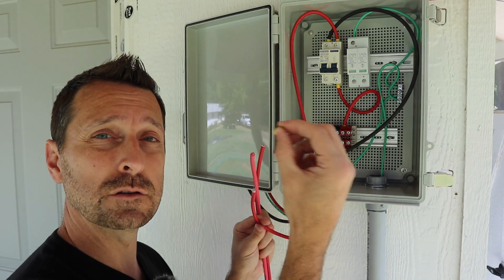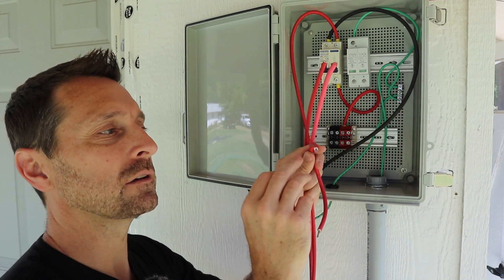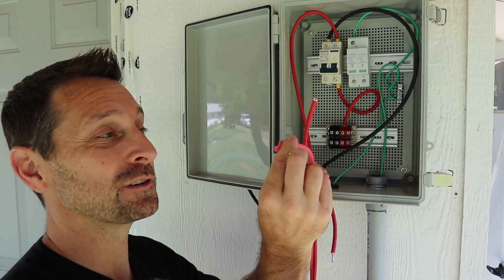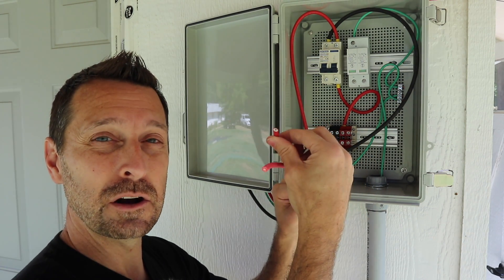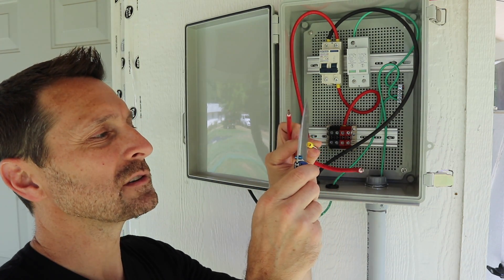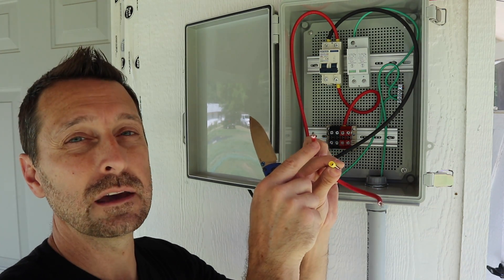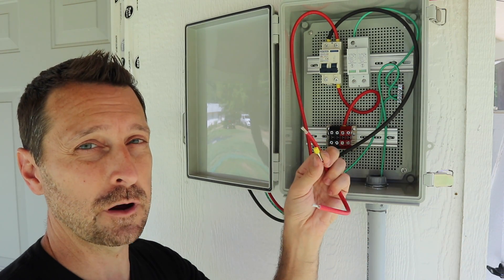It's recommended that you put ferrules on the end of your wire, especially if it's thinner stranded like PV wire is. However, most ferrules that you find, the little shroud at the end is too big to go on this PV wire. This PV wire from Signature Solar is almost twice as thick as the one I got off of Amazon, so that certainly is not going on this wire. What I did was I just sliced down both sides of the little shroud so it would fit over the end of the wire. You can leave the wires bare if you choose or put the ferrule on.